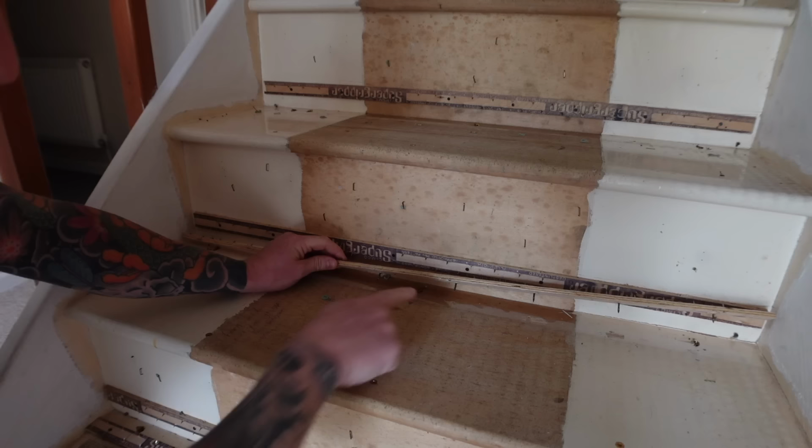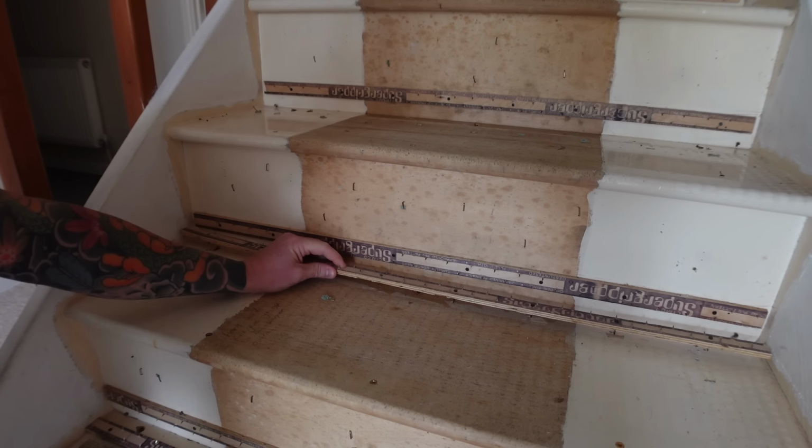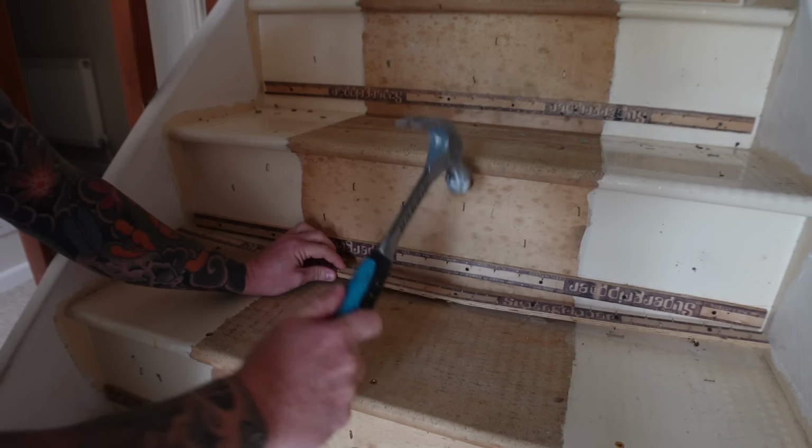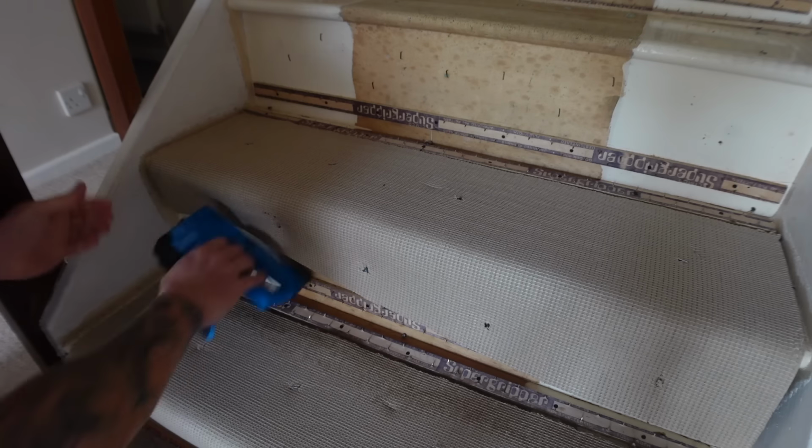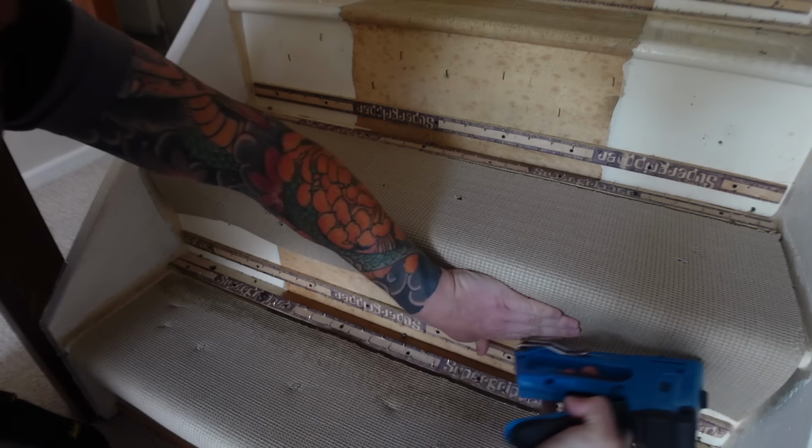Now we just want to let that glue go off overnight and come back in the morning and put the carpet back down. Now you'll be able to see where the old marks were for the grippers. Now the underlay. You'll want a staple gun for this. I'll link one in the description. Pull the underlay tight and use the staple gun to fix it in place.